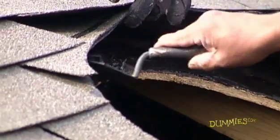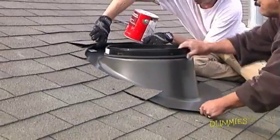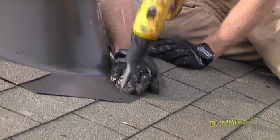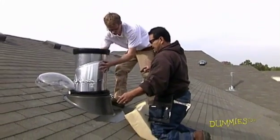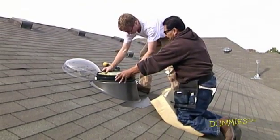Remove any roofing material, apply mastic around the rough opening, put the flange in place on top of the mastic, and secure the flange over the opening using the screws provided. Replace roofing material around the flange. While you're on the roof, install the pivot ring on the upper elbow, remove the protective film, and drop it in place.